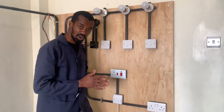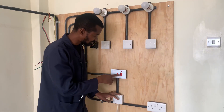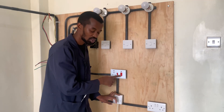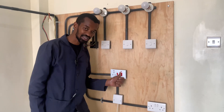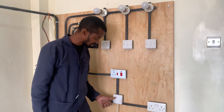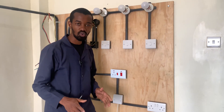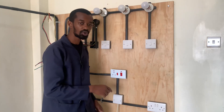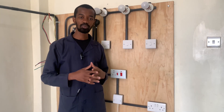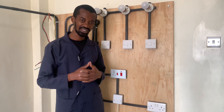This is how the cooker should be connected — connected to the connector and fed at the cooker unit. The heavy switch here is the one that activates the cooker connector, which now supplies the current to our cooker. It is not advisable to connect the plug to the normal socket here because it will not be able to handle the large current drawn by the electric cooker.